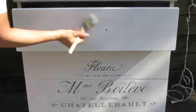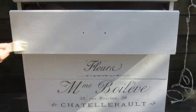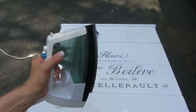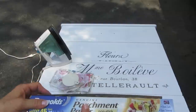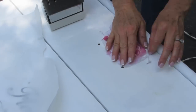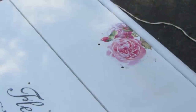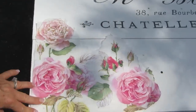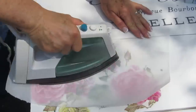I put my napkins aside. I really wish I would have had a large sponge brush — I'm using a bristle brush here, but I don't think that's a good idea. Cover the whole front of the dresser with decoupage glue and let it dry completely so it's not tacky to the touch. Then take your iron, parchment paper, and napkins. Separate all of your napkins, look at your picture, and place the first napkin down where you'd like it. Put parchment paper on top, iron set to the cotton setting. It's okay if you go over the drawer lines because we'll use a straight edge to cut through those anyway.